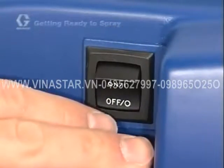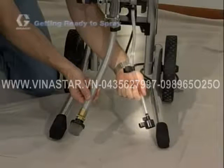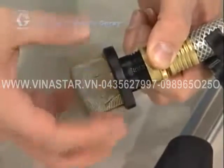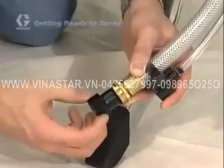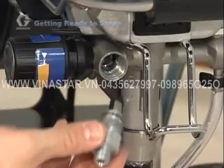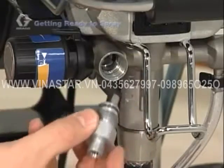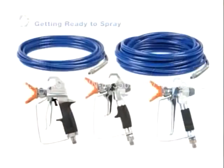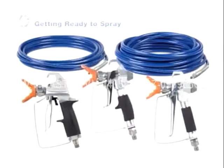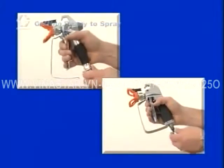The power switch is located on the backside of most sprayers. The suction tube — the larger of the two tubes — draws the material or paint into the system, while the smaller prime tube or drain tube is used for draining material or waste from the system. The inlet screen is located at the bottom of the suction tube and prevents objects such as twigs, leaves, or rocks from being sucked in and damaging your sprayer. The power flush attachment is an easy way to clean the sprayer's system if you're using water-based paint. Some Graco Magnum sprayers come with an InstaClean filter that keeps you spraying longer by reducing spray tip clogs; it is automatically cleaned when the prime valve is used to relieve pressure. Other Graco sprayers include a manifold filter that should be removed and cleaned after each job. Your Graco sprayer comes complete with an airless spray gun and hose, and all Graco guns come with a tip, tip guard, and a removable gun filter for easy cleaning after each use.